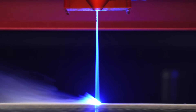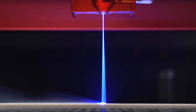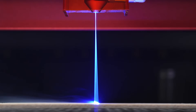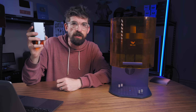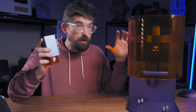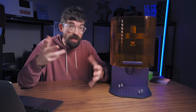You may have heard me talk about diodes and beam size in terms of the number of diode modules inside. Normally they are around 5 watts, so to get higher power you add additional diodes and combine them optically — which gives you a messier beam. That's why a 40-watt diode laser is not going to be as precise as a 5-watt diode. But that is totally different from what we're talking about with the special crystal re-emitting a new laser beam after the diodes pass through it.